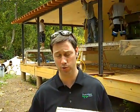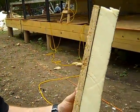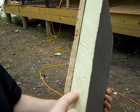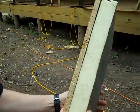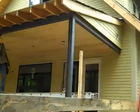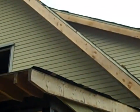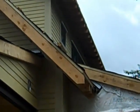We've got a fairly new system that takes it one step beyond that. This is a product made by Hunter Panels in Houston. What you're seeing here is two inches of poly iso foam bonded to a half inch of OSB, or oriented strand board. This house is a fairly typical A-frame looking house, and if you can see that roof line, you're seeing the edge of the poly iso.